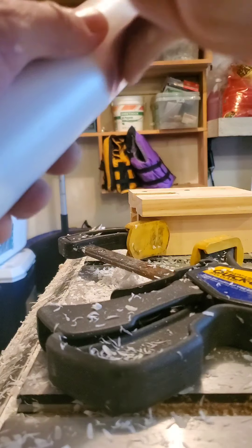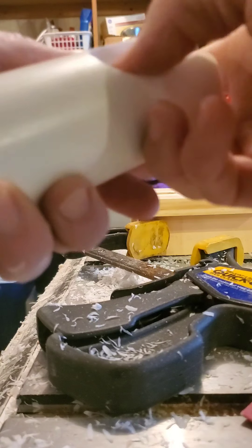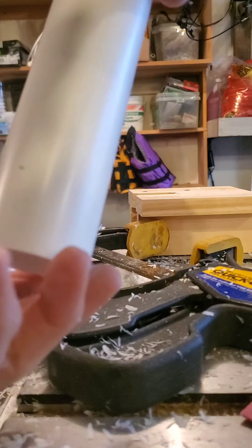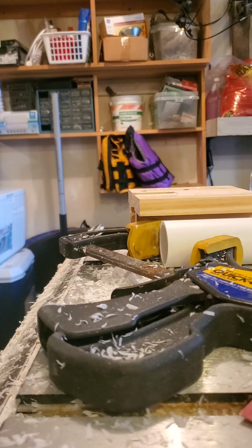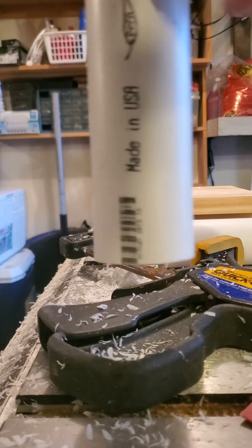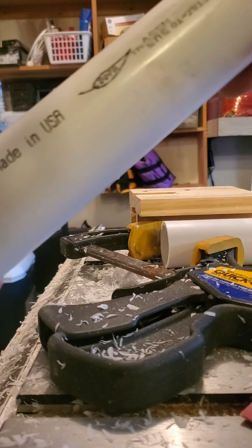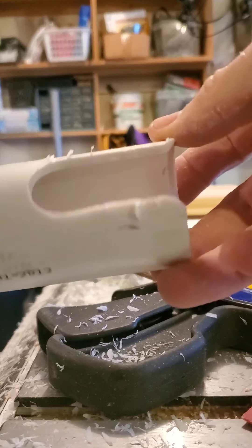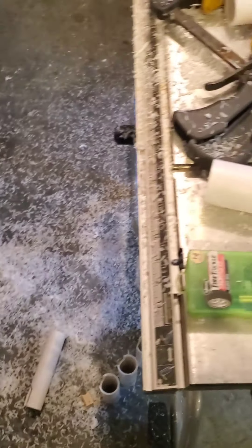As you know, if you work with PVC, it can cut you. This one's all clean and doesn't have any print on it, but some of them have a stain or print from the store. Here's one that has print all over it — we'll just use some 220 sandpaper to take that off so you don't see it. Another note: routering PVC makes a gigantic mess. But we'll get all these sanded, cleaned up, and then we'll get them installed on the boat.